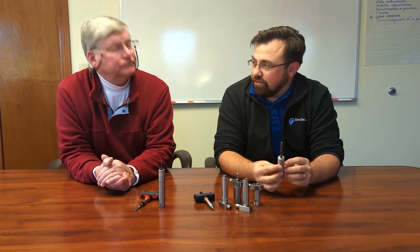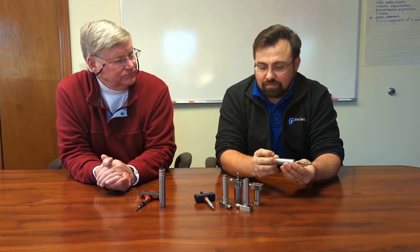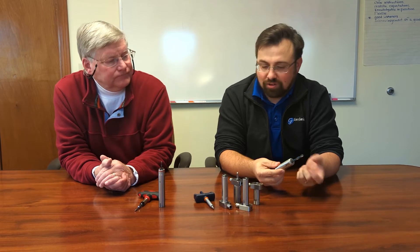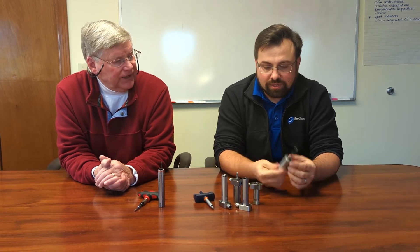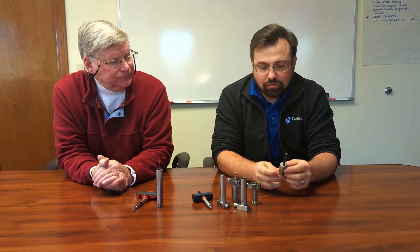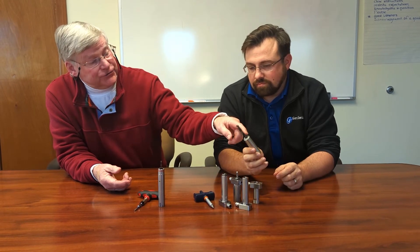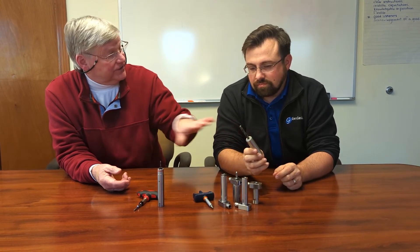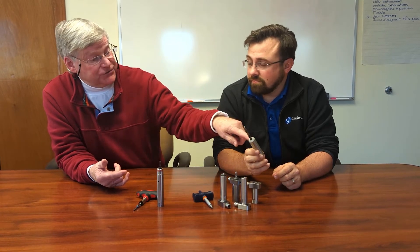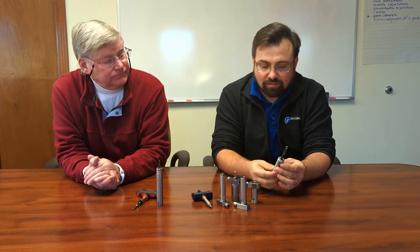These are semi-standard products with blanked materials kept on the shelf, but if somebody needs something for their very specific need, adjustments can be made. We can do metric and inch. So if you've got a half inch or a 12 millimeter, and you're limited by the diameter of the tool position you're going into — that's a good solution for cooling-through larger shank drills. There's a nice relationship between the shank of the larger drill and the ID on this, with great positioning using two set screws. It's a simple product, but a good problem solver.